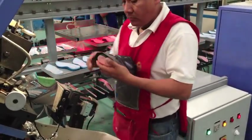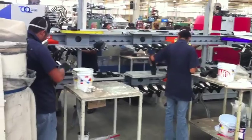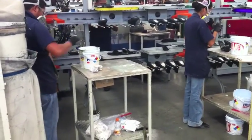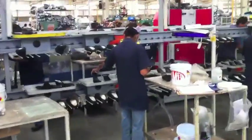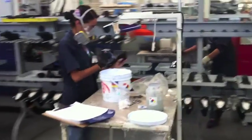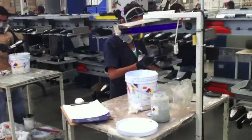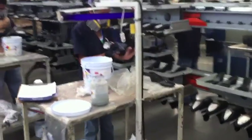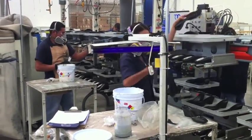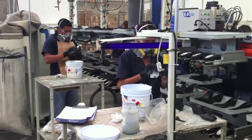The fusion of two different traditional conveyors into just one FlexiLine allows workers with faster operations to work for both levels, as we can see in this image. That means that the number of workers required in one FlexiLine is lower than the one needed in two separate lines. Therefore, FlexiLine saves space, increases productivity, and offers the flexibility required by the current footwear manufacturing industry.